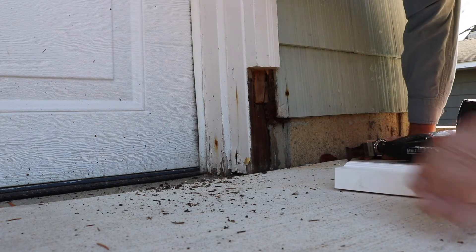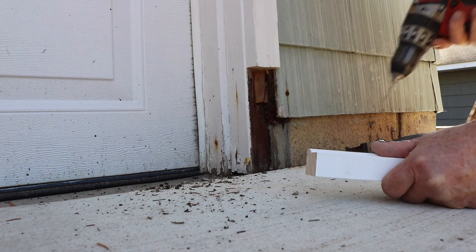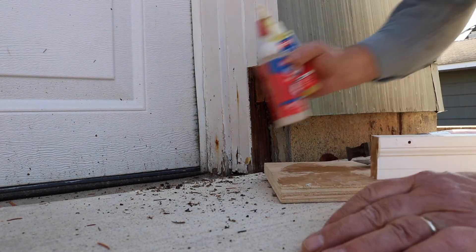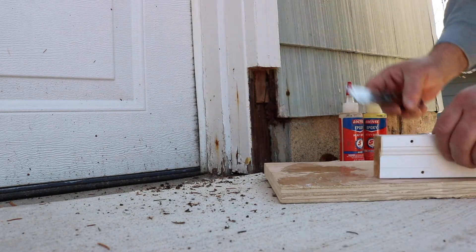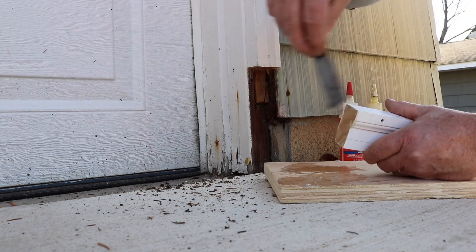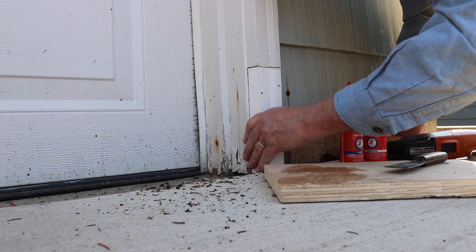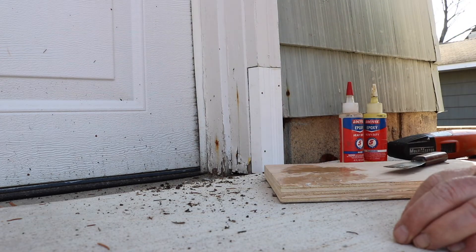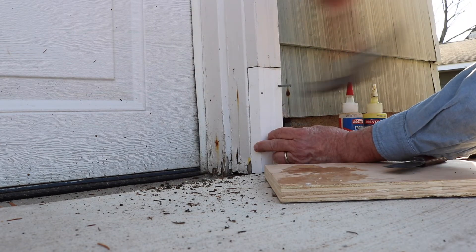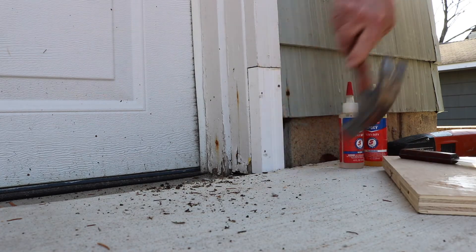So what I'm going to do now is mix up a little epoxy, put it on here, and then pre-drill a couple of holes to run a couple of nails in. I've mixed some epoxy and I just put it on the top like this, so in case water wicks in there it's protected from rotting again. I'll slip that in place, make sure we're tapped in there good, and set the nails.